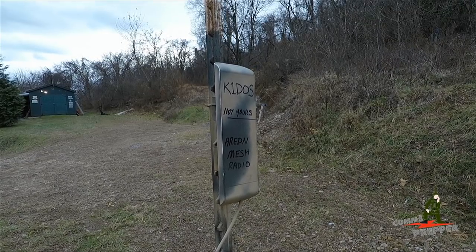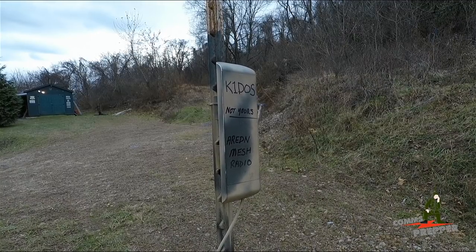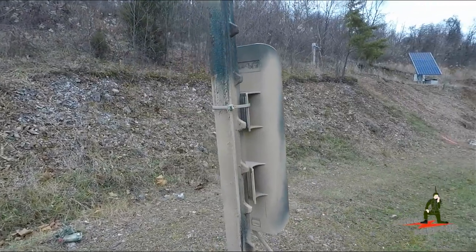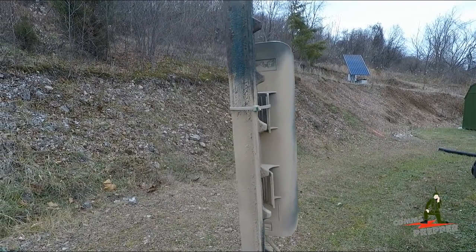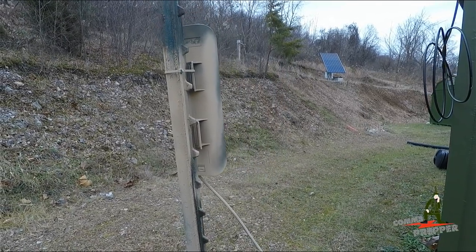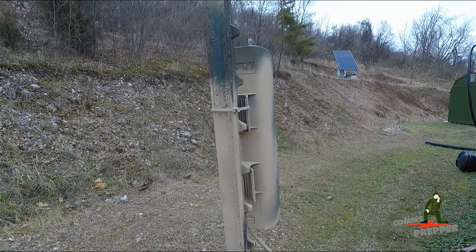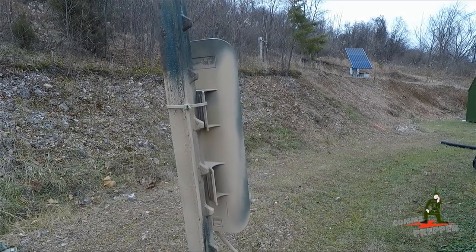This is a wireless transmitter for a digital network. It's also a router and a DHCP server all in one unit. I'll walk around here real quick. In this configuration, I did the camo paint. Normally these units are white. I have the radio sitting here on a pole temporarily with a zip tie, and some Cat5 cabling goes into the retreat, connected to a managed router, which is a VLAN connected to my Linksys home internet. It has a gateway feature, but right now I have that turned off.